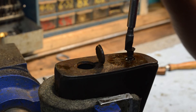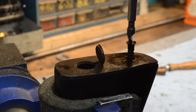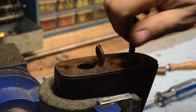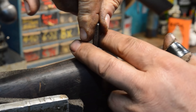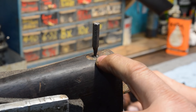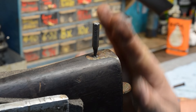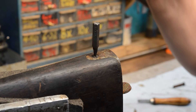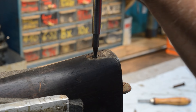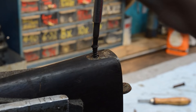There we go, that came out. Same deal up here — this screw here, put the screwdriver bit in it and tap it in. Don't use too big a screwdriver bit either, because if you've got a screw sitting down inside a mortise you can drive the screwdriver in and actually split the head of the screwdriver and wedge it down inside the mortise. Here we go — oh wow, yeah, these things are jacked up.